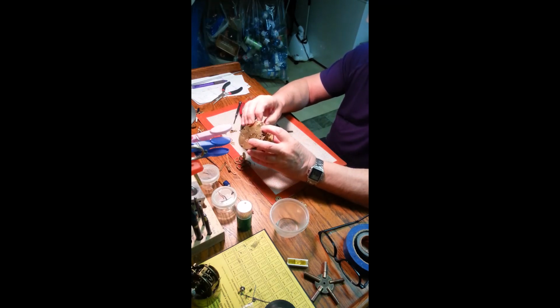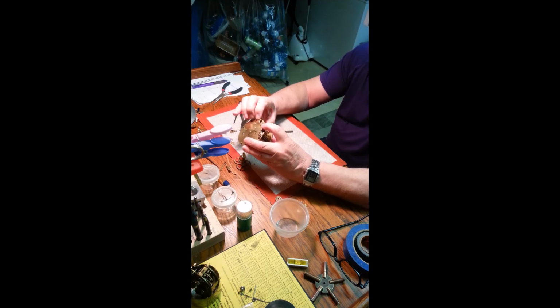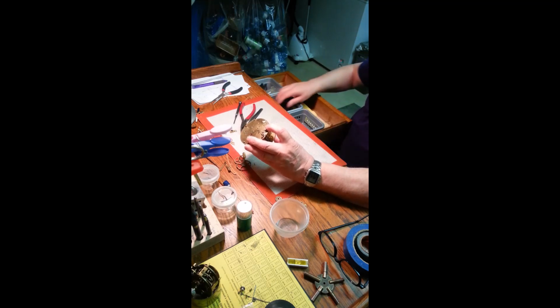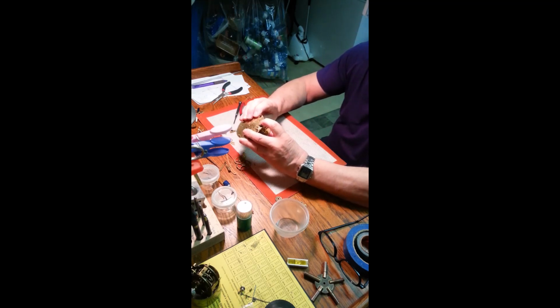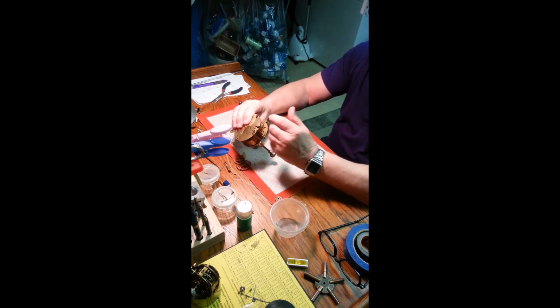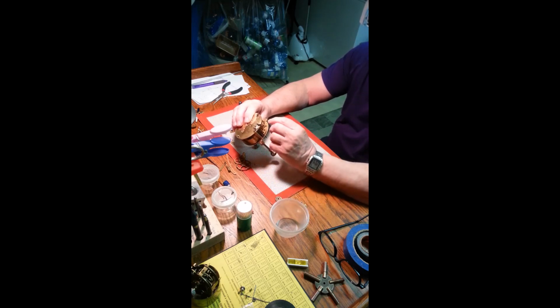In order to expand these plates and open them, you have to remove all of these except for one, and these they're not very pliable. On a movement with thin plates, I use this plate spreader, but I wouldn't use it on a French movement with thick plates. I just don't trust it. And what's happened to me is it slipped off, and it smashed down and broke the pivot off, usually the fan wheel. So when you have a broken pivot that small, I can't repair those even with my lathe. It would be quite a job on something that small.